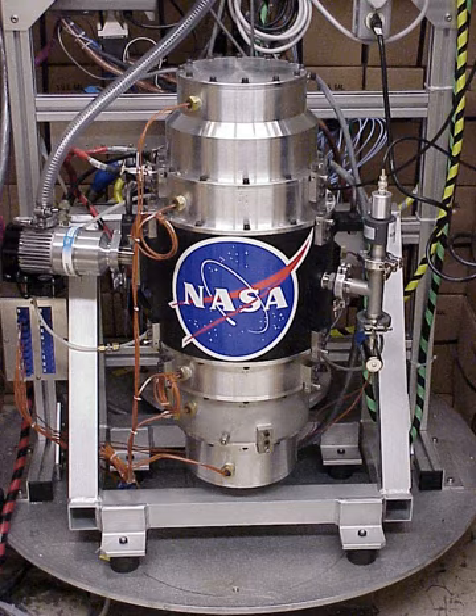Magnetic bearing flywheels in vacuum enclosures do not need any bearing maintenance and are therefore superior to batteries both in terms of total lifetime and energy storage capacity. Flywheel systems with mechanical bearings will have limited lifespans due to wear. The physical arrangement of batteries can be designed to match a wide variety of configurations, whereas a flywheel at a minimum must occupy a fixed square surface area and volume. Where dimensions are a constraint for the application of an energy storage technology, such as under the chassis of a train in a tunnel, a flywheel may not be a viable solution.